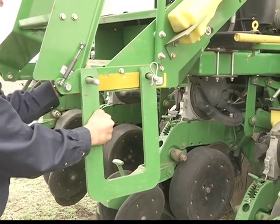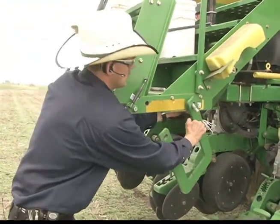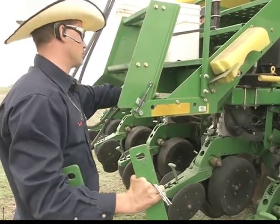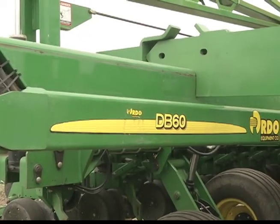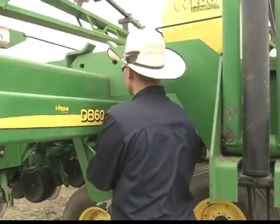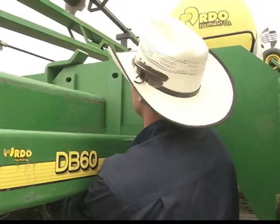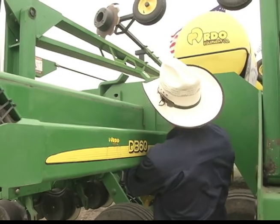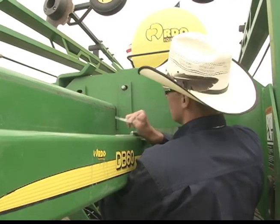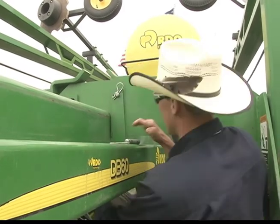This is the stowed position for your center safety to hold the wings together. Pull your hitch pin clips out, your pins, and the U-shaped flat steel. Once removing the center frame service lock from the rear stow position, slide it up into place around the frame. Install the hitch pin clip.